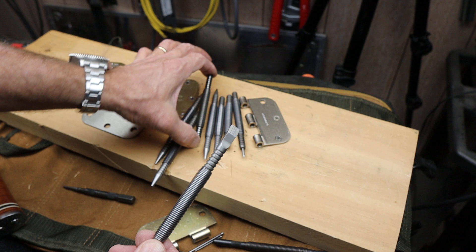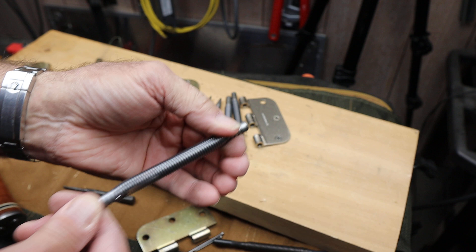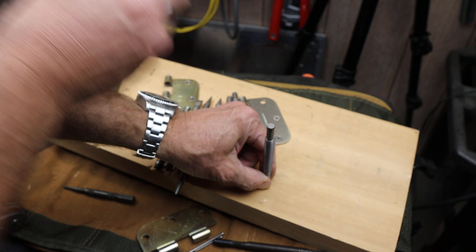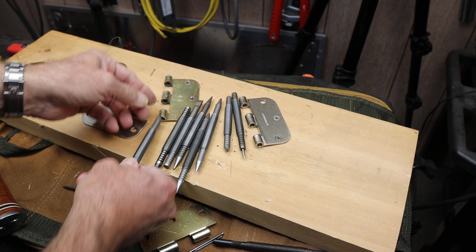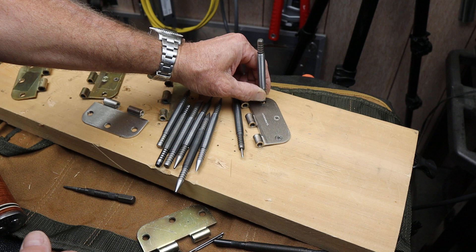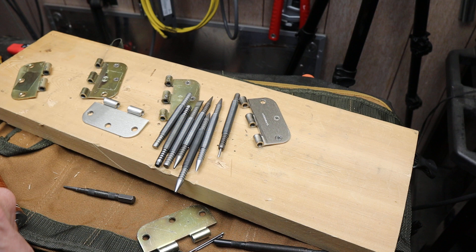This one basically is a hammer — it's got a holder and you can reverse it and smash with the flat side as well. In fact, you can with all of these — it's the same force inside. This one has a recessing pin so you can put it flat up against something to pop something free if you've got a little pin that needs extra force. Same with this one that has the recessing striking area — you push down and it automatically centers. Give it a whack and there's a nice centered hole. Beautiful — all sorts of uses.